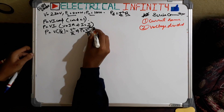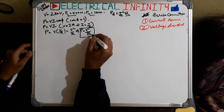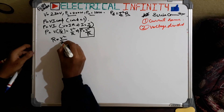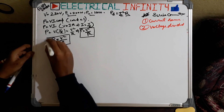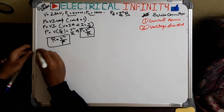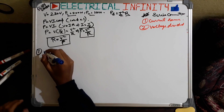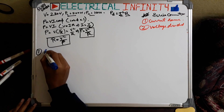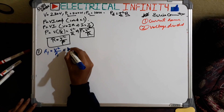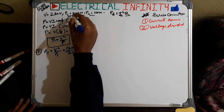So the formula is P = V²/R, which gives us R = V²/P. By substituting the values of V and P we can get the resistance of both bulbs. For R1: R1 = V²/P1 = 230² / 200 watts.